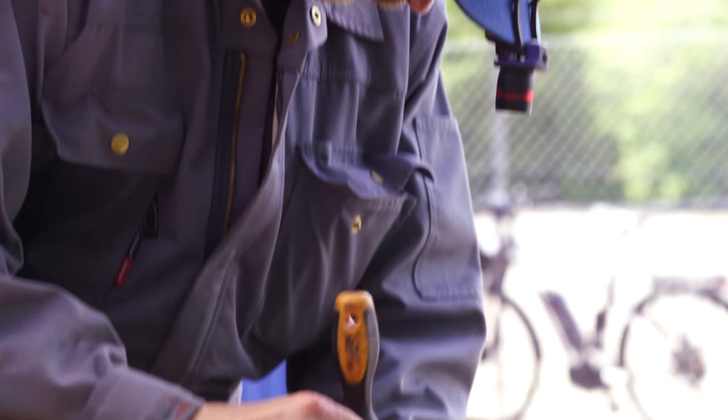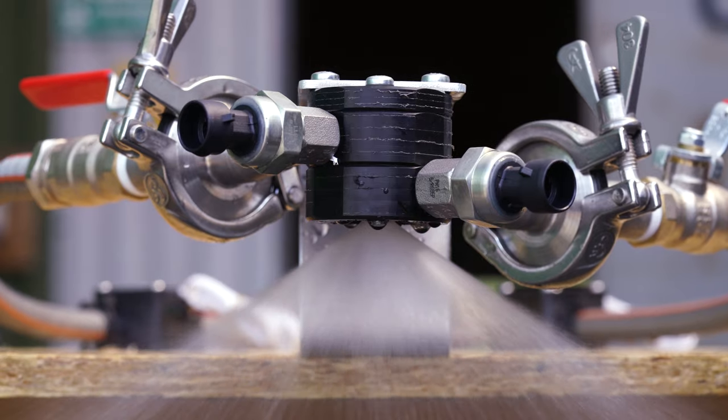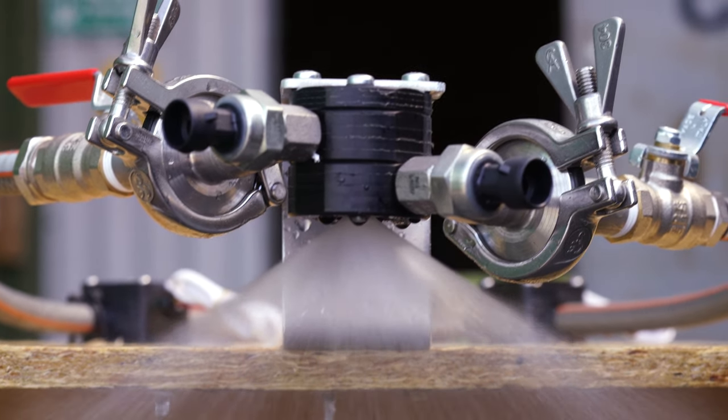After getting the first couple of swirlers ready for testing, we took them to our little test setup. The purpose is to measure pressure on both sides — both the oxidizer and fuel sides — and also to measure flow on both sides. We have two pressure sensors and two flow meters. The data logging software isn't entirely ready, so today we basically just ran some water through the swirlers to visually see that it looks okay. What we can see is that they produce a cone which is fairly open. I would have liked the cone to be a little bit steeper, but for now it's okay — it's something we can test with.